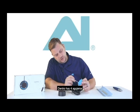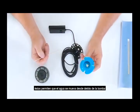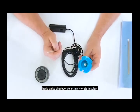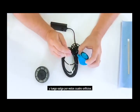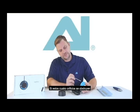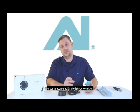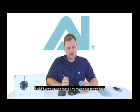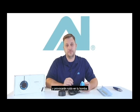Inside there are four holes and these four holes allow water to move from the back of the pump up around the stator and drive shaft and then out these four holes. If these four holes become clogged, either with lubricant from our testing on the line or from detritus or calcium buildup, it will impede the water flow causing the bearings to heat up, which will then result in your pump making noise.